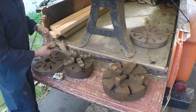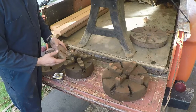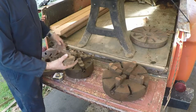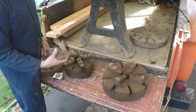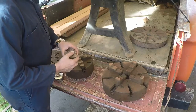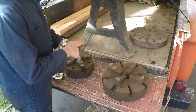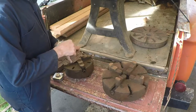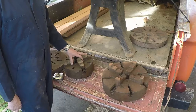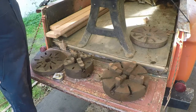I'm very happy that these came with it — the toes on the legs, or the feet. They're broken off on the other end, but luckily we still have the pieces, so this can be repaired. I might take it to lock-and-stitch just so you guys can see how that process works. It's pretty neat — they fit it up, drill it, drive screws in there, and the screws overlap and actually interlock together. I've seen them rebuild blocks on great big naval ships with that technique.